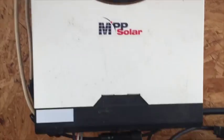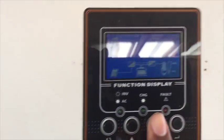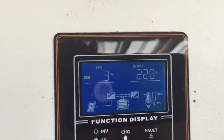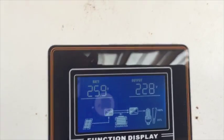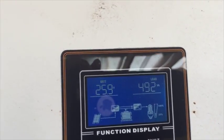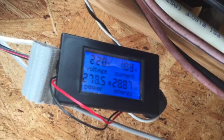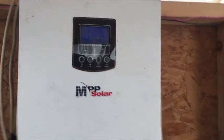Number two — the meters. They're not very accurate, so I'll buy my own. Inside here, it says zero volts input coming from electrical output on the AC pad. It says three amps going to my batteries, but realistically it's probably closer to nine amps. The voltage — 25.9 volts — most likely is accurate; I've been able to gauge that and it's off by about two tenths of a volt. But the wattage is definitely off — it kicked up to 280 watts and then it's showing 240. I don't like the fact that those meters are so inaccurate.